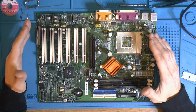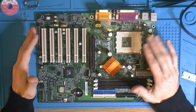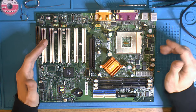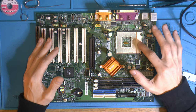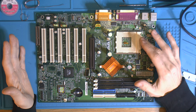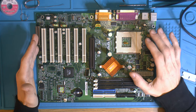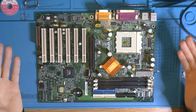This board, from what I read, is limited to Athlon XP 1800+ at the most. MSI didn't want to support any higher. There's something about the socket or pin's current limit, but it doesn't make that much sense, I think, because a Thunderbird 1400, I think, pulls more than an 1800+, if I recall. I haven't tested, obviously, but I suspect you could actually run faster CPUs because they seem to use the same BIOS, but there could be some way they're limiting that.